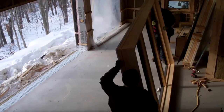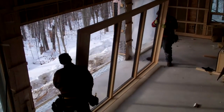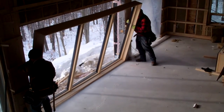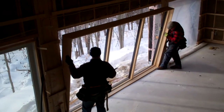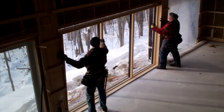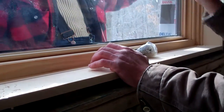Rough openings are made bigger than the window so you can slip your window in and have a bit of room to place it. You normally see windows set up on blocks or shims to raise them into position. If you leave those blocks there, they're going to act as a thermal bridge and can create condensation. One technique to avoid that is to fasten windows into place. If you're using wooden blocks, foam on either side of those blocks — once the foam sets, it's structural and will hold it. They're screwed down anyway, so you can pull those blocks out and foam in those holes.